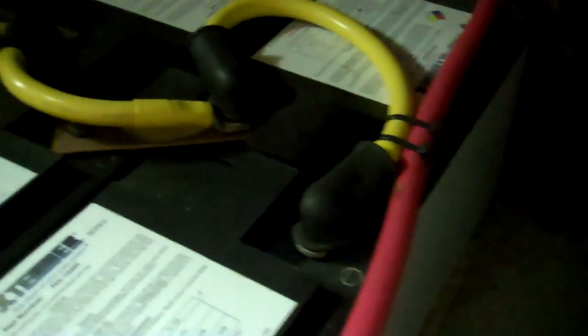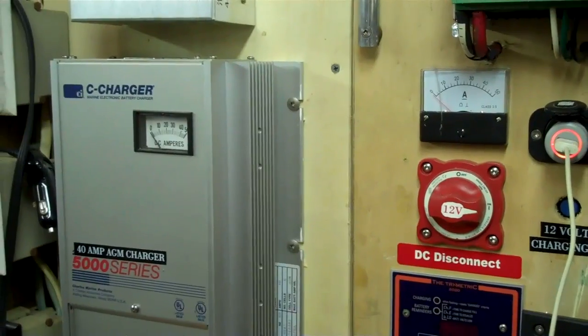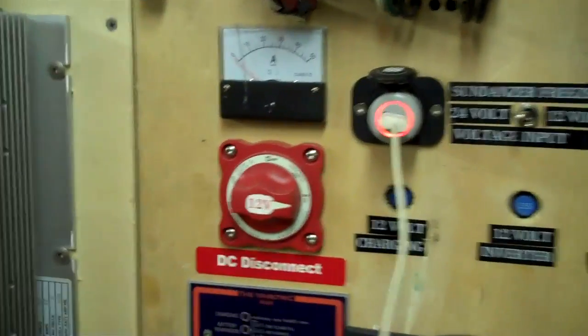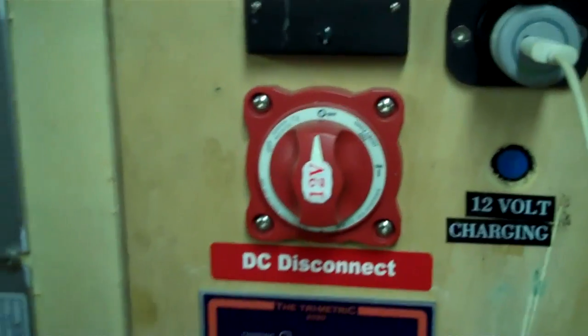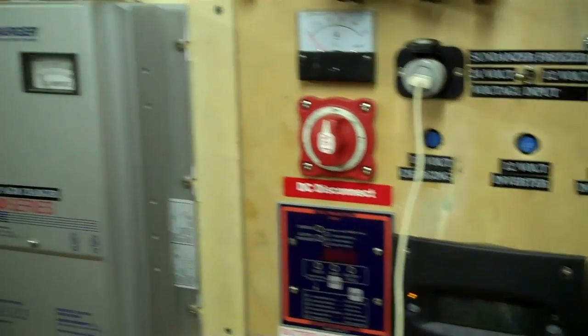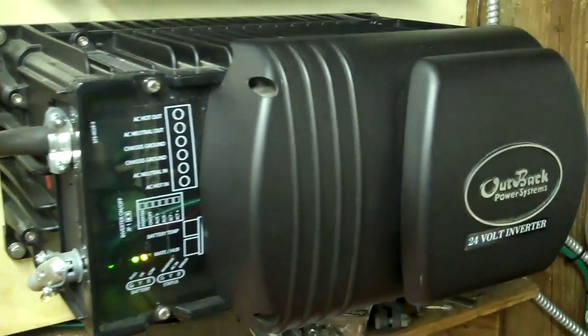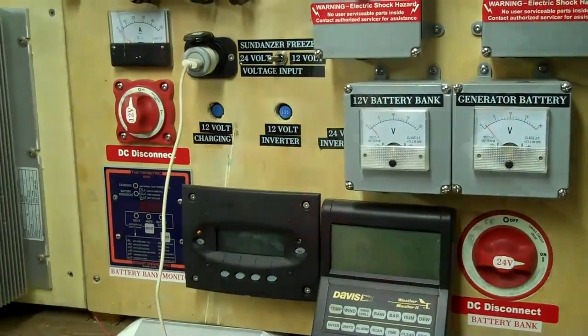What I'm going to do is remove the entire negative cables and bars so that I can test each battery individually. I'm totally topped off and I'm going to shut off the battery bank. You really got to think this through. Make sure inverters are accounted for, and you definitely want to take the lines and loads off your battery bank so that you don't create any sparks. This also applies to testing a regular lead-acid battery bank.